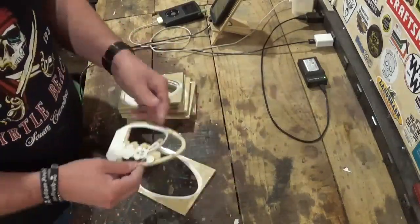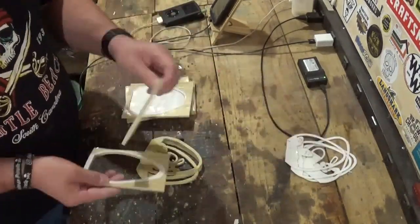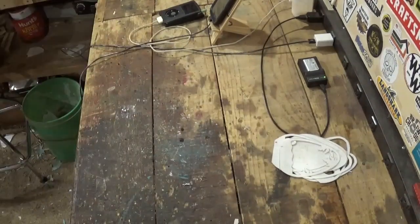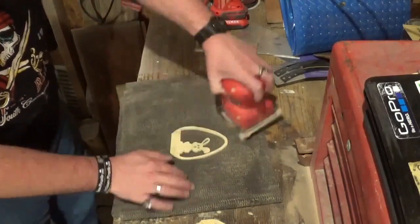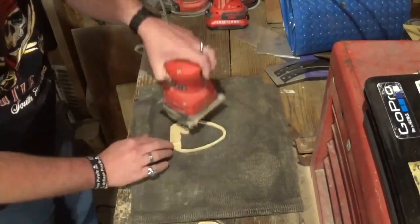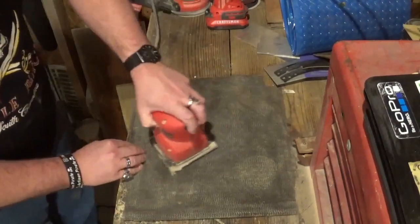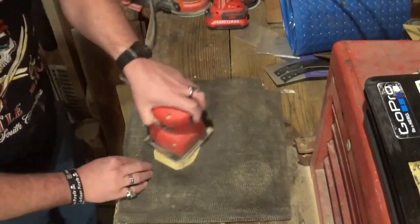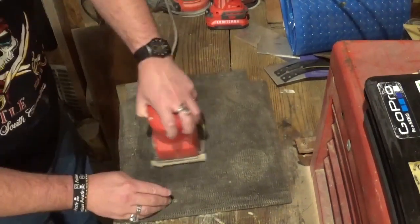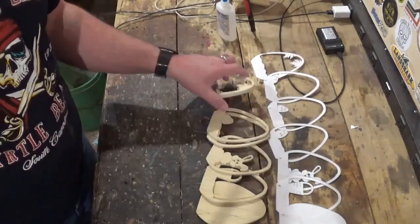But once all the cutting is done, we'll remove the patterns from the wood and the waste material, and I'll keep the patterns because they have numbers as to the layers when it comes to the glue up. Sanding everything here with 100 grit sandpaper and the palm sander. Taking my time and being careful not to break anything. But once everything is sanded, we will proceed to the glue up with CA glue on the workbench.